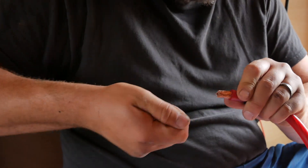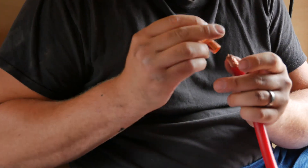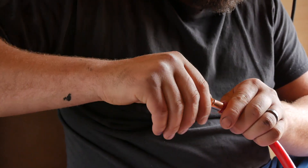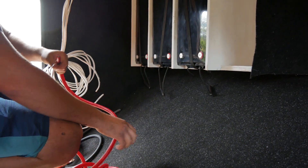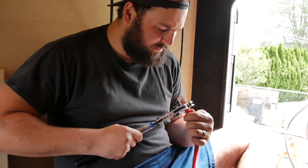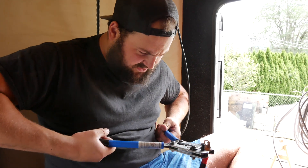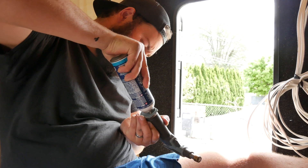We are wiring these batteries. We bought some cable — some of you are going to ask why we went with number one gauge. Because it was cheaper than number two, that's the only reason. We need to wire these in parallel. We'll put our boards on and then mount our inverter and everything on there. For the inverter, we didn't end up going all-in-one. We went with everything Victron, just not the most top-end configuration.